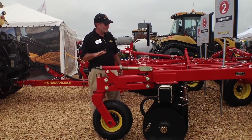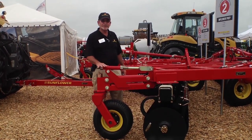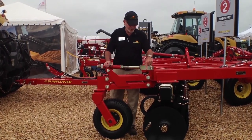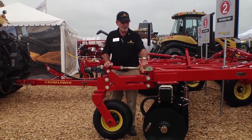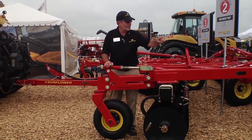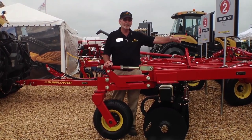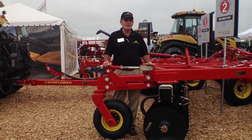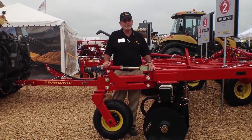Match the horsepower, so we're pulling the unit between five and six miles an hour and not exceeding that. The thing with the disc harrow is if you're going faster than that and you throw soil further with the front gang than you can reach with the rear gang to pull it back in, you'll ridge the tool — you'll ridge the field. The tool is designed to operate at about six miles an hour maximum speed.